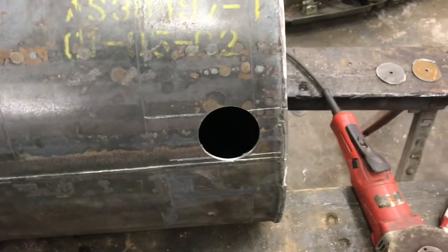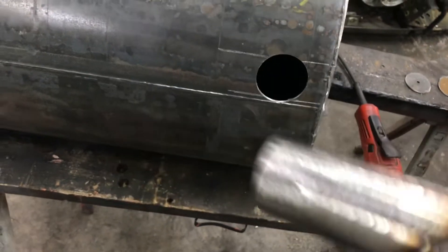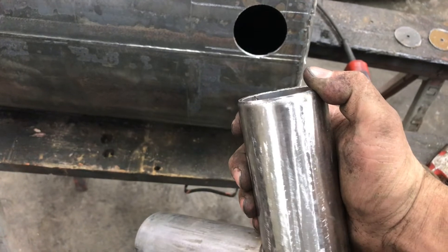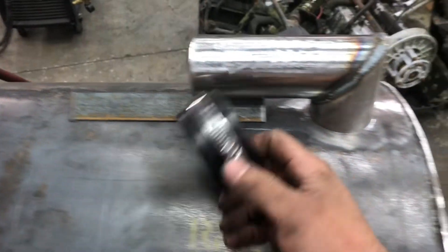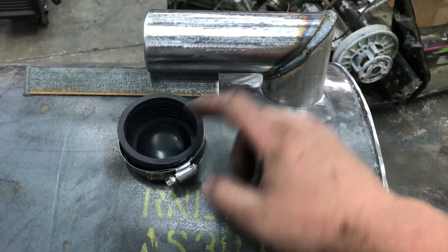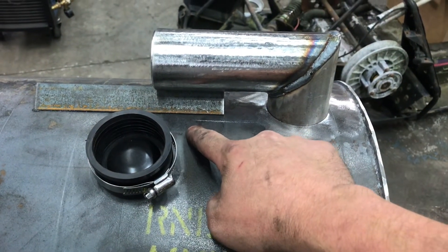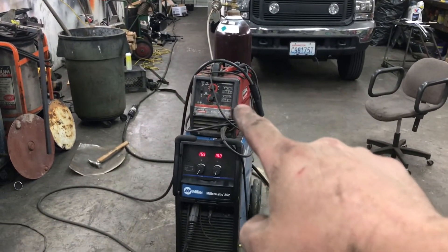This is all welded up down here, so the last thing we need to do is our gas lines coming out of the top. I bucked the hole. I'm running low on material — this is two-and-a-half-inch pipe going inside the barrel, and the two-and-three-eighths outside diameter pipe coming off the leg where I joined the two together. That'll slide right in the hole. One thing to keep in mind — I actually screwed this up on my first truck: you're going to have a Fernco that connects on right here, so you need enough room between the bottom of the gas outlet and your container to slide it on. Mine is super tight to the barrel on the Toyota. Also, I didn't have enough space underneath to complete the weld all the way around — I couldn't get my MIG gun in. Luckily I have a little Lincoln. So this time I'm making sure I have enough room to run one welder and do the whole weld all the way around.